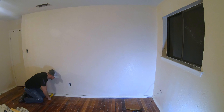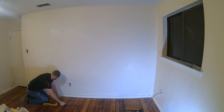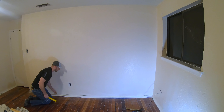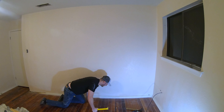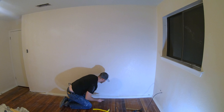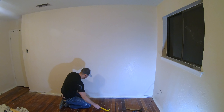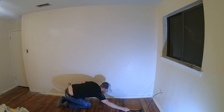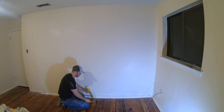To make this a little bit easier — this is called quarter round. There's a baseboard here and there's this little section called quarter round. I'm going to pull that off first to see what I'm working with. That will come off a lot easier — just like that. There's caulking on there too, so let's cut it. I'll be a little bit more forceful with this because I don't have to worry about the drywall and the floor is getting replaced.